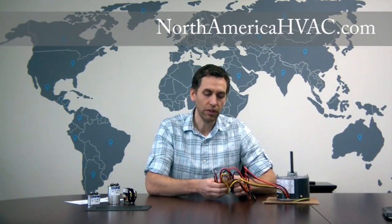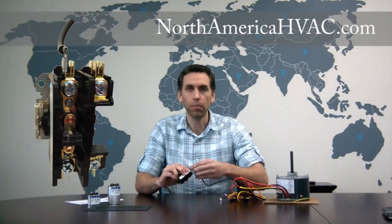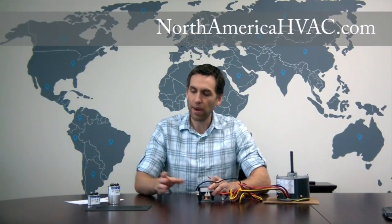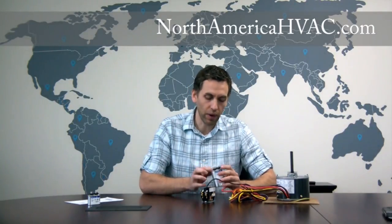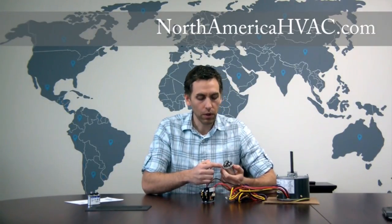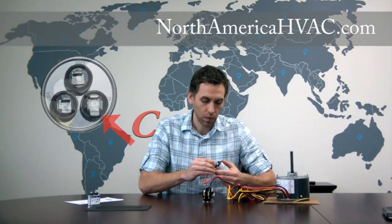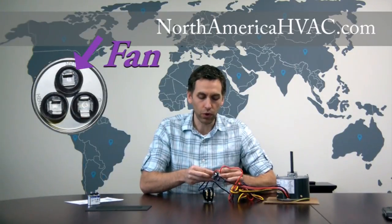For the three-wire replacement, if you have a three-wire condenser fan motor and you get one of these two motors to replace yours, you're going to take the black wire and hook it to the top of your condenser contactor, just where the old wire went, which was probably also a black wire. Then take the orange wire — you'll need a dual capacitor, and all three-wire motors operate on a dual capacitor, so you'll have one in the system. Look for the terminal labeled C and put the orange wire on there.